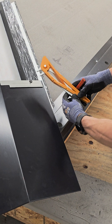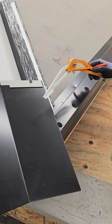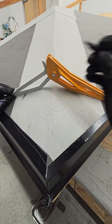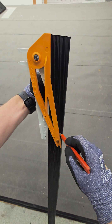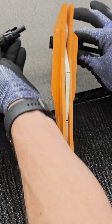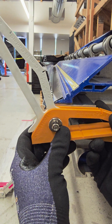The Robin Jig is a multifaceted Tesla solar roof tool that can help installers make quick references on common roofing features. The Robin Jig can be used to mark chalk lines for hips and ridges, trace out cut or bend lines on channel flashing and hip caps, easily disconnect PV tile connections, and be used to reference angles.